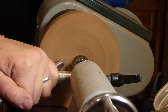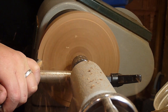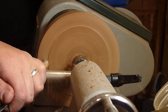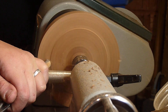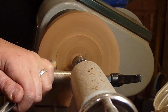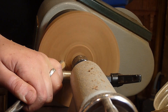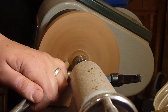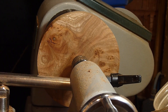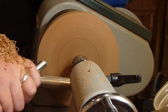Cleaning up the face now, ready to put on the chucking point. We're going to be using a tenon — you can use a recess if you want, but I just prefer tenons. A nice little bit of slow-mo action there with a push cut. It would have been better if they were curls rather than chips, but you can only ask so much of really dry wood. There's a bit of burr in it, and using the push cut helps eliminate end grain sticking up or tear out.